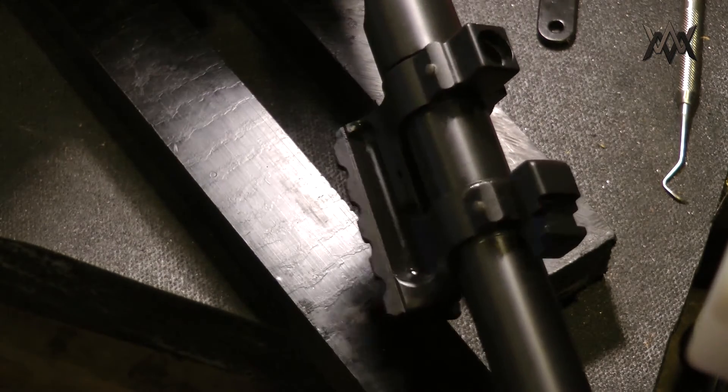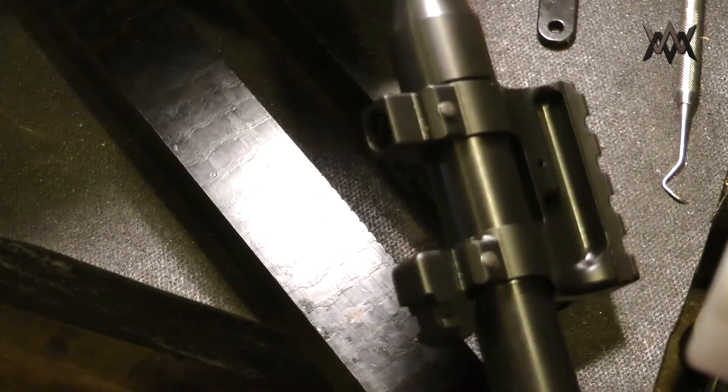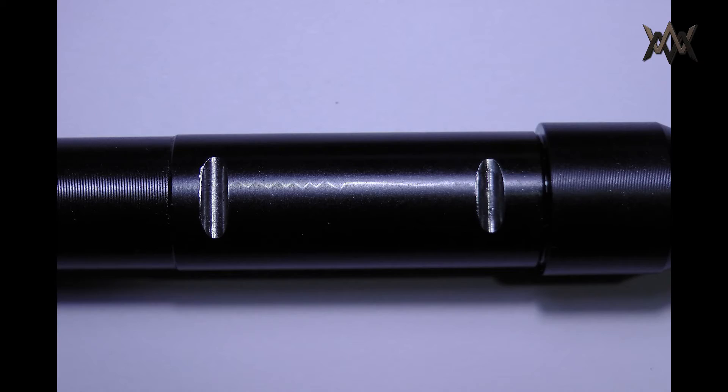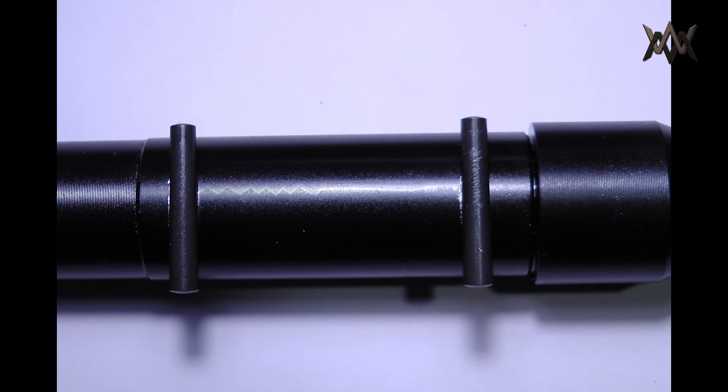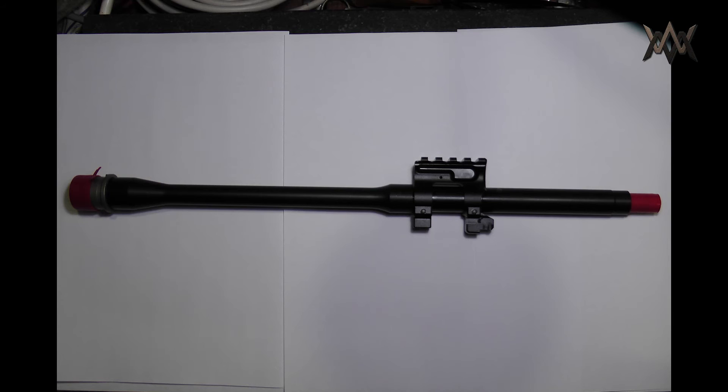The proper depth is when the pin is protruding from both sides equally — you can see I pretty much got it there. That's what a proper pinning job will look like. As far as the location of the pin holes, they should be drilled right on the edge of the barrel so the cutouts look like half circles. You don't want them to go in further. The best case scenario is right on the edge — when you drive those pins in, they'll force the mating surfaces of the gas port together. You want half the pin in the barrel and half out. Thanks again and see you in the next video.